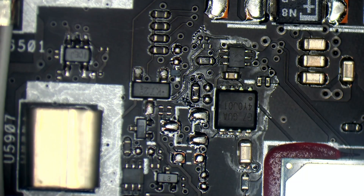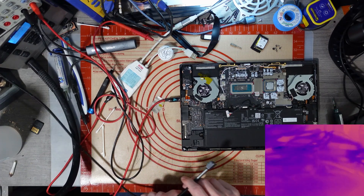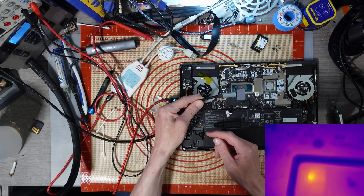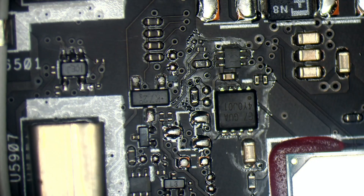So the MOSFET's getting a little bit warm, but not as warm as the CPU. Current's going to take the path of least resistance to ground, and the CPU is probably going to have a lot more resistance than the MOSFET itself. But that very prominent hot spot is very, very worrying. I think this is probably the CPU, but I'm not sure about the jumpers — because if those jumpers have shorted something out, there is a chance that would go to the CPU given that they're going to be jumpers for data lines. But I don't think that would be giving me false readings.